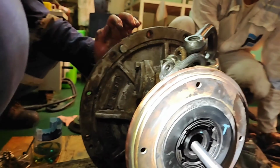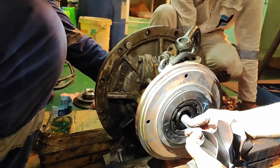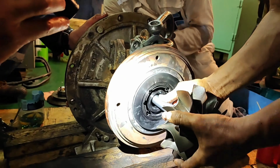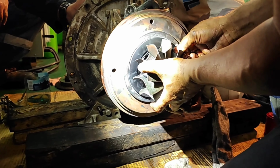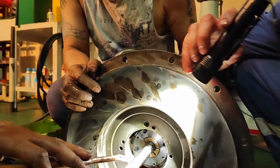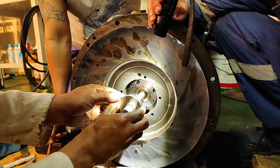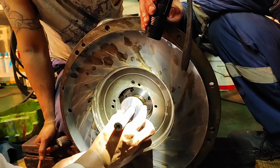Insert the rotor shaft 60A into the bearing pedestal 30. Take extreme care so as not to damage the labyrinth packing fins. Apply lubricant to the turbine side thrust bearing 71 and to the thrust collar 63. Insert the thrust collar 63 into the rotor shaft 60A.